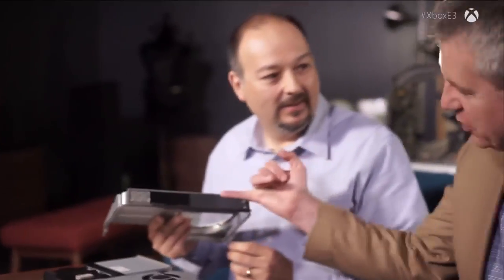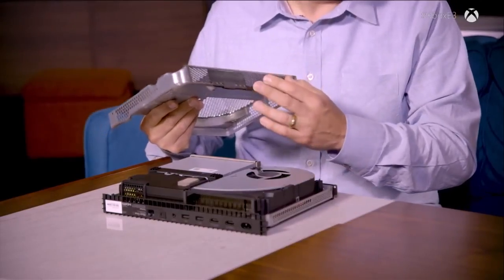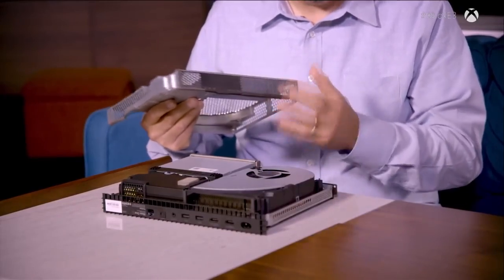That little space between the holes is thinner than the material itself — it looks like a knife edge. All of the tooling engineers and mechanical engineers we talked to before we did this said we shouldn't even try. But we worked at it — we have fantastic tooling engineers who love a challenge. These are punched holes, not laser-cut holes. Laser cutting would be easy, but you can't do that in production very easily. We actually punch these holes mechanically and they are perfectly flat and aligned.